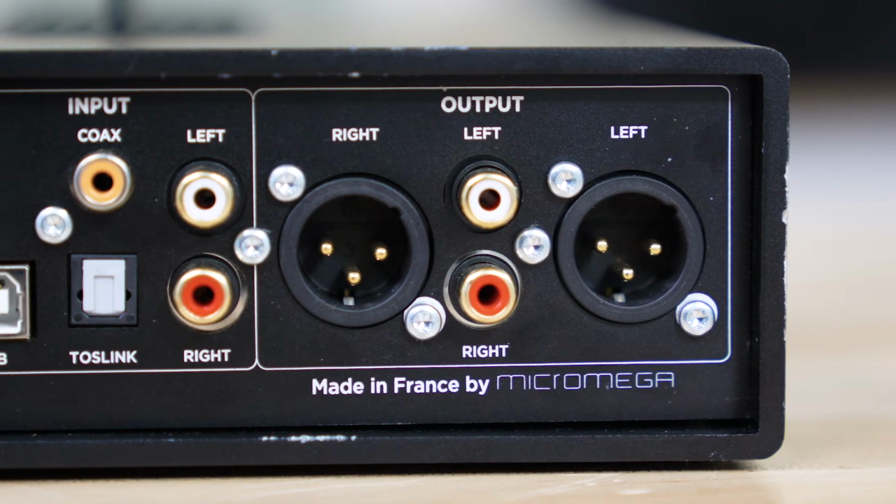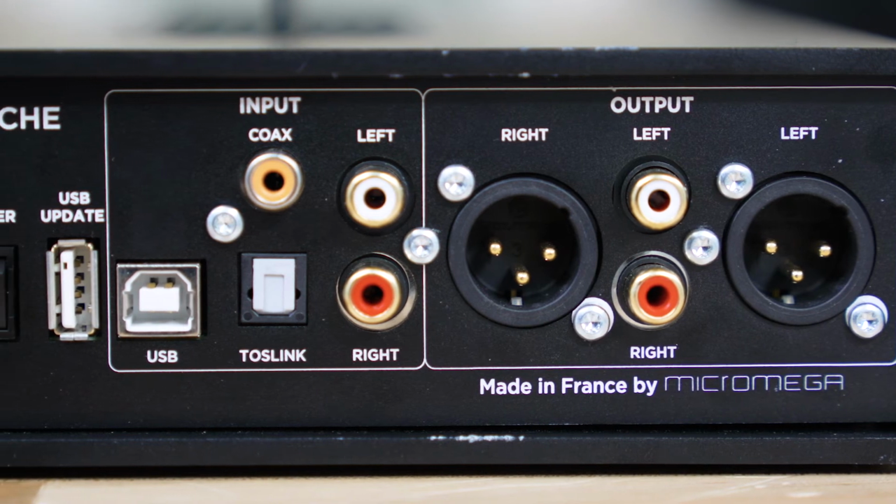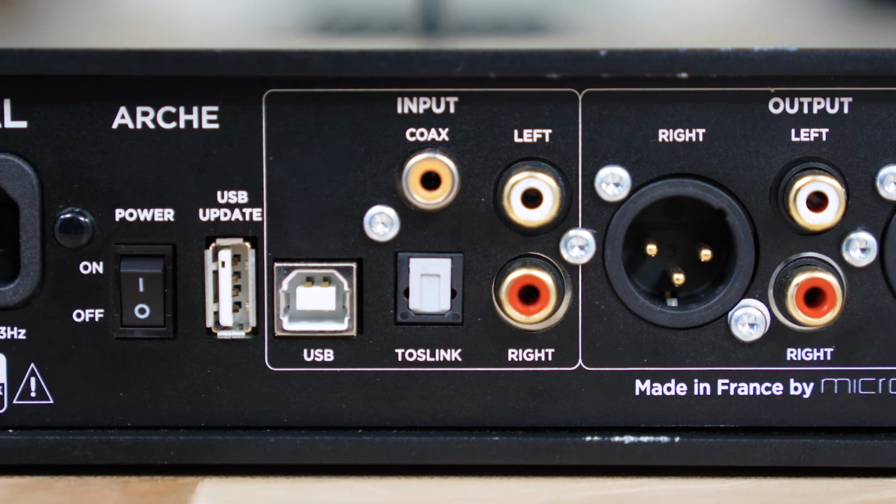Then after the DAC, it goes to the amplifier side. Here you have, once again, one dedicated power supply per channel in regards to the amp design. And all the amps, left and right, are pure class A, 2 × 1 watt, and class A from 16 up to 600 ohms headphones.